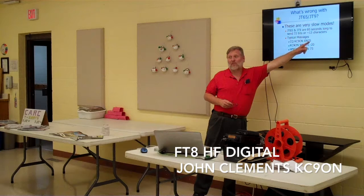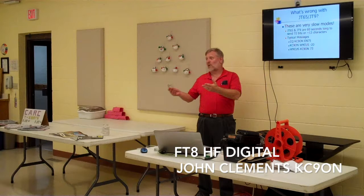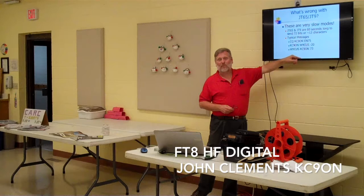So you can send a call sign, and you'll see like a negative 20 or a plus 4. And that's basically your signal level, your RST report. Or you can send a call sign to call sign and 73. Sometimes I'll send my call sign, whoever I'm talking to's first name, and 73. You can only send 13 characters at a time in 45 seconds, so it's really, really slow.